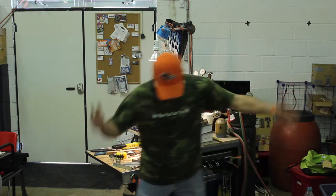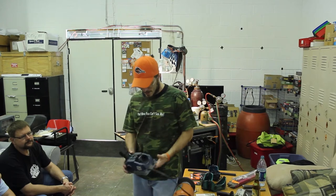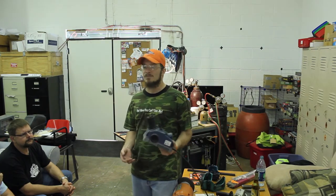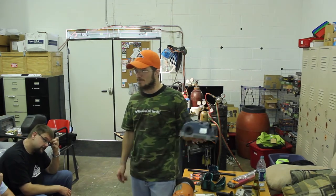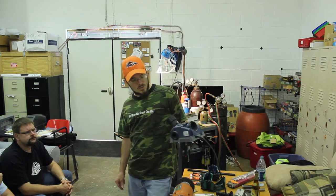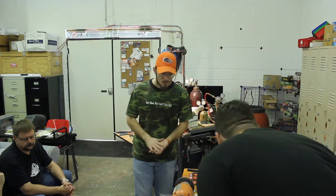Okay, so we're going through various general tools. Drill Doctor, another tool I highly recommend. I had a guy ask me just yesterday, is that thing crap or is that for real? Dude, this thing is for real. I've got drill bits coming out my butt. I find drill bits on job sites, just on the ground, wasted, thrown away because they were no longer sharp. I take them home, I sharpen them with this thing, $10, $12, $20 drill bits. This is like a $60 one. They have a $100, $120 one, and I actually recommend it because it does additional things like put a split tip on the end for holding the bit steady, for getting into a different type of material.